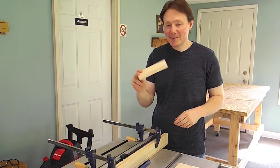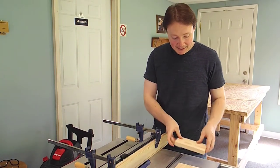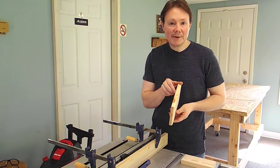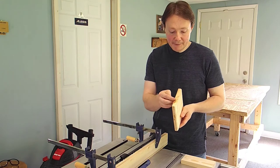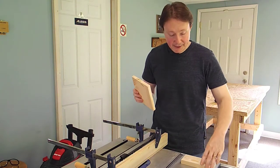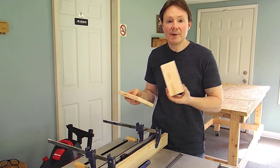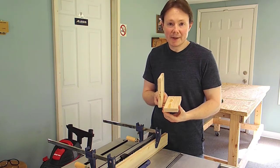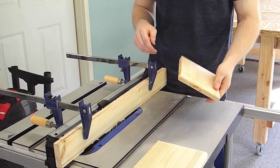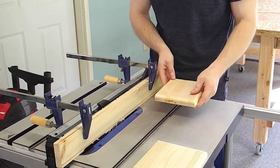Here's our center piece. We have it ripped down to 2¾ inches. Now the reason for that measurement is that we're going to hook this together using rabbet joints. This is ¾ inch material, so we're going to be cutting halfway through that. That'll leave us 3/8 of an inch on each side, which will be taken away from this bottom piece — that's ¾ of an inch — so we'll have 2 inches left in the center to hold the napkin. Now we don't have a dado blade for our table saw so I'm going to have to do this rabbet joint with 5 or 6 passes across the blade.